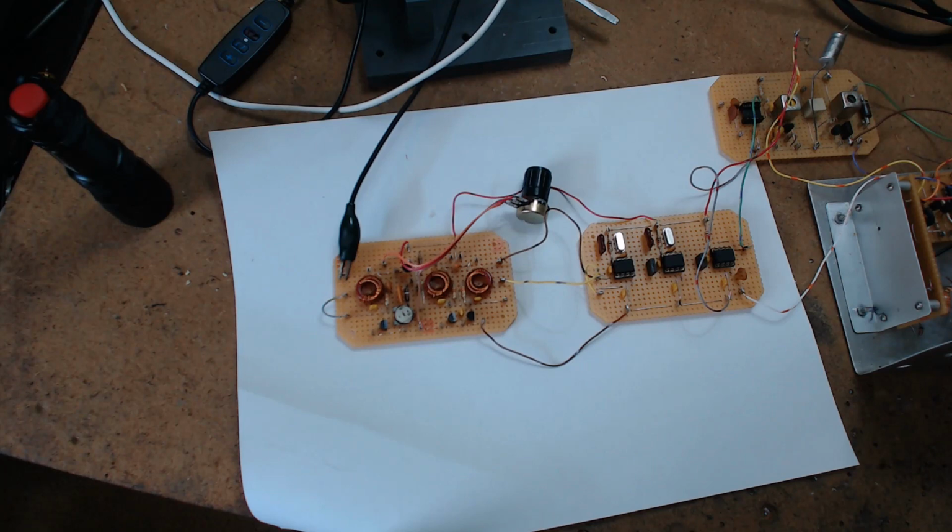If you go look at real shortwave radios, and when I say real, I want to talk about stuff the military used. They later on went to transistorized, but if you look at a military radio, the front end has an incredible amount of coils. And radios you buy, ham radios, they still have some coils in there. And the portable cheap stuff that you get on Amazon has even fewer coils. SDRs have almost no coils. There's certain things the radio has to have to work properly, and they've dumbed it down.